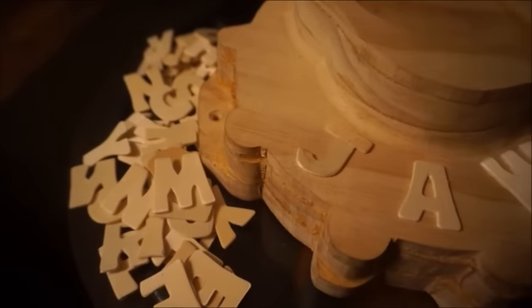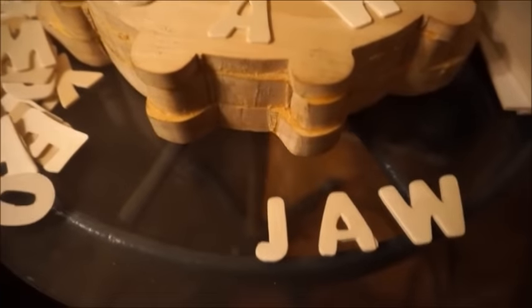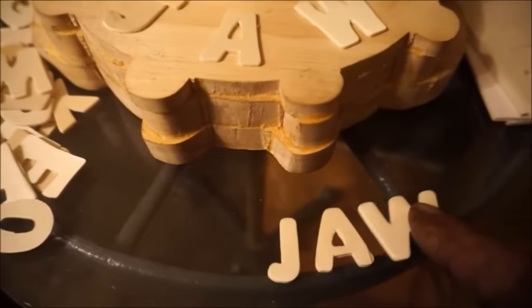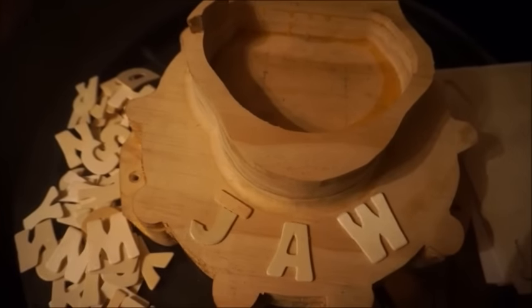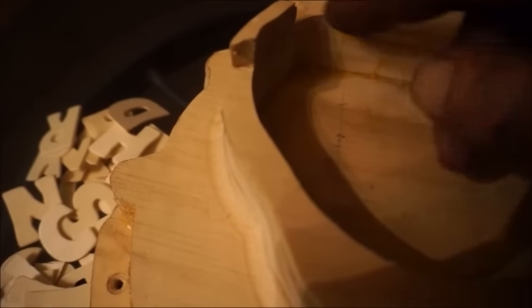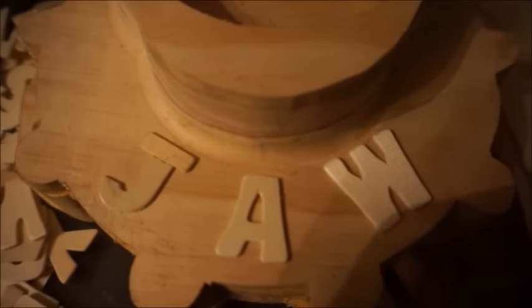I decided I wanted to put some initials on this thing — my initials — and we'll cast them into it. I made a stop by Walmart and bought a few different kinds. These are thicker; I don't like how the J is so small compared to the W. The J didn't have a line at the top, so I cut one off something else — a T actually — and put it on. I'm going to move them where I need them and glue them on, then go in with some bondo right around them to relieve it a little bit so we can get it out of the mold. I got the piece glued back in — haven't cut it off or machined it yet. We're getting down to the nitty-gritty here, just about done.